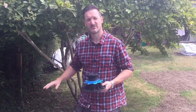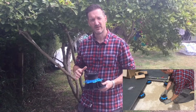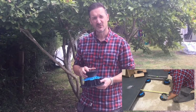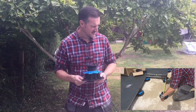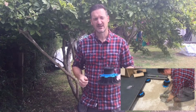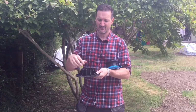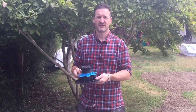So what we've done here is we've dug down 200mm and we've put down 100mm of type 1. That's been compacted thoroughly. So what you need to do is work on each pedestal individually. What I tend to do is use a mallet, and if it's not sitting quite correctly, lift the pedestal out of the way, tamp the ground down, put it down again and put the level on it. It's probably best to put it down with a level on just the base itself. Get that level as you can, and then put your adjuster and your collar and everything on the top.